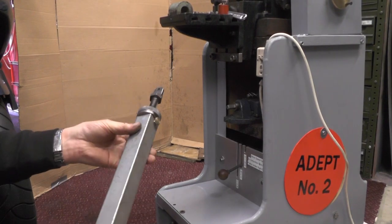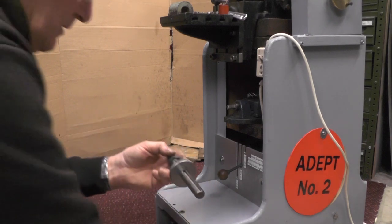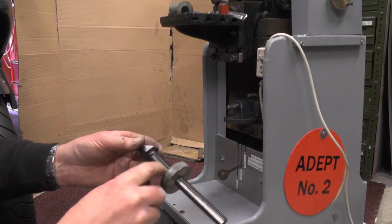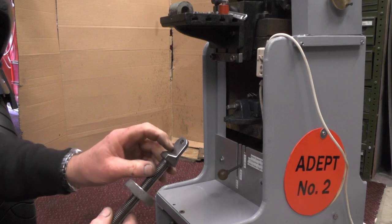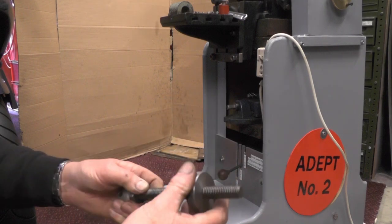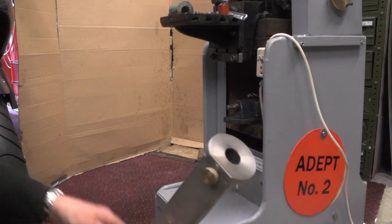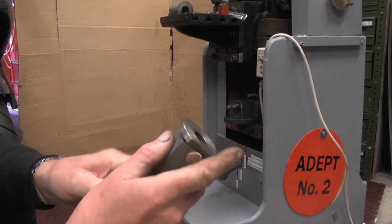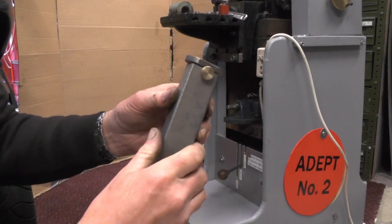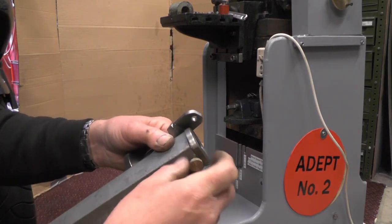Okay, let's have a look at what I've been up to here. It's a five-eighths BSW screw, six inches long. I've milled a keyway in the whole length, I've welded a bracket on the top, I've made a knurled nut that's an easy fit on the bolt, I've got my piece of square tubing, and I've made an adapter for the top.